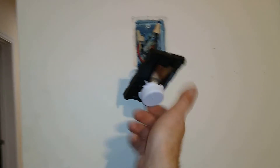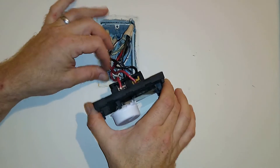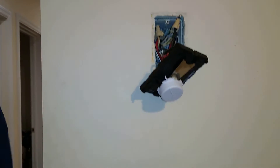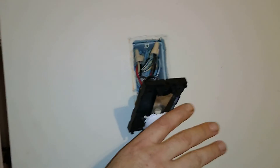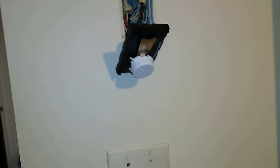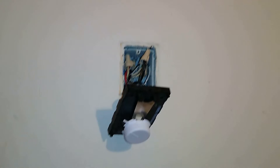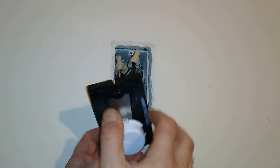Turn it on, run it for a few hours, then go to your breaker and cut it while the thermostat is still on. Come over and set your finger on the wires here and here — see if they're heating up. If the wires are still heating up, it means you didn't get rid of enough corrosion, or you're running too much baseboard off of this thermostat. If you're running too much amperage, run one baseboard, or sell your two 10-footers and buy two 5-footers to run half the amperage. This will keep your house from burning down — this is a 220 line, not 110.